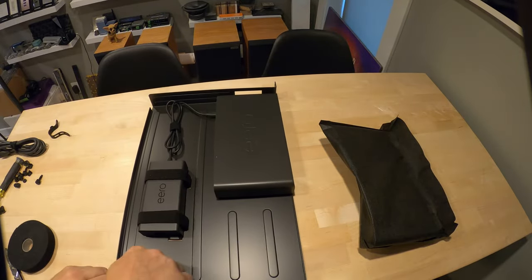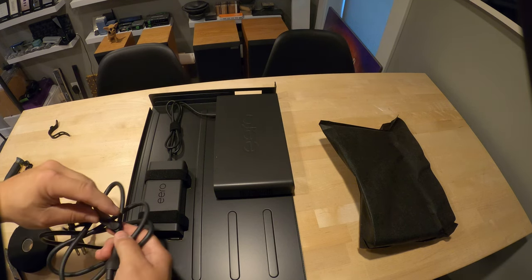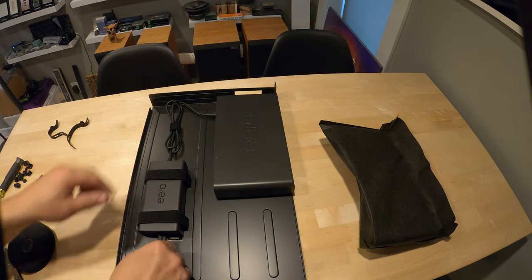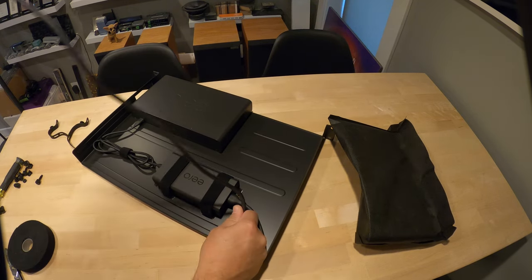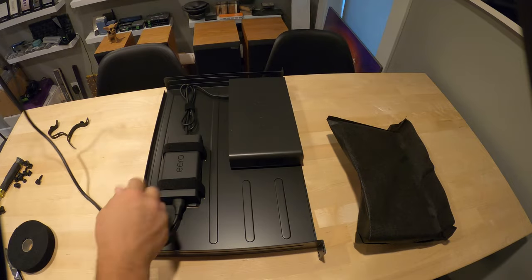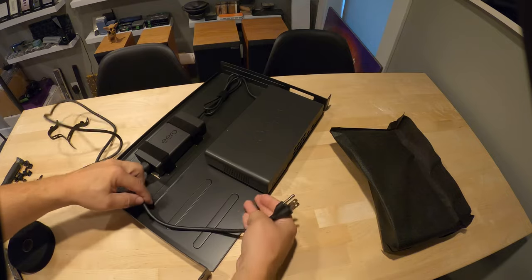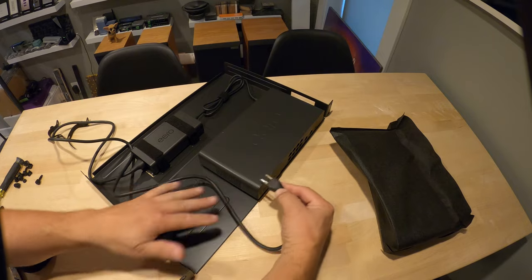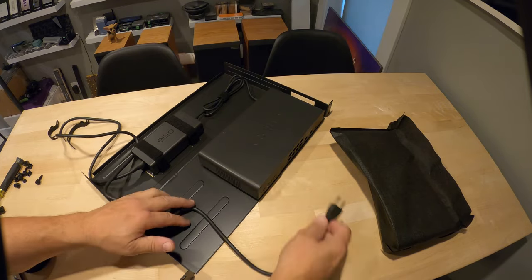And then they didn't really give you another eye loop for the power, which is probably good. Again, we'll probably get rid of these little plastic rubber things on most of the jobs we do. They're little tie straps. We'll get that plugged in. And then depending on your power, you obviously have this racked out to your power. So in our case, we actually have a power strip going right up here. The only advantage of maybe having this open is we'll do a service loop and we'll plug this right back into our power that's going to sit here in the rack. It's battery backup with the front power. So for the time being, we'll just do a nice little service loop on this.